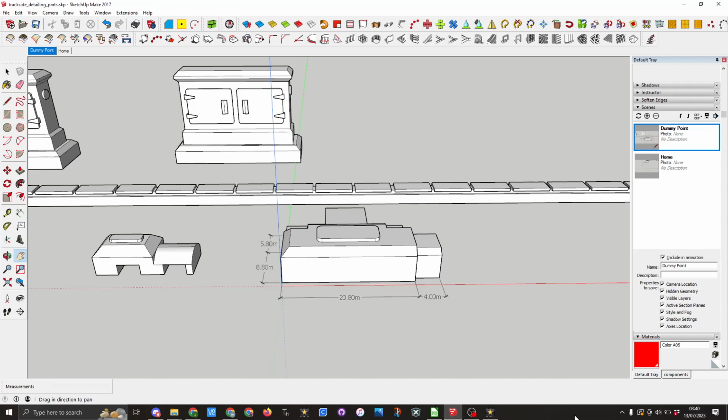Now if you look closely you will notice for this set of drawings I'm actually using the architectural meters, but I am designing to the size I want it to print out, so I'm treating millimeters as meters. So you can see here we've got 20.8 meters. When that comes out, that little bit there will be 20.8 millimeters in size.